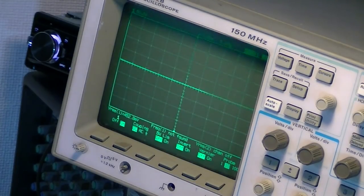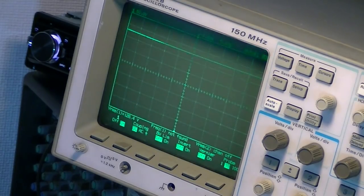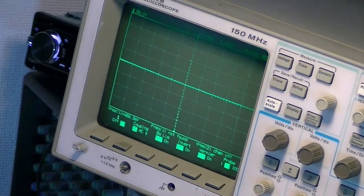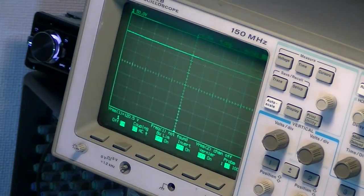Now let's just wait for that voltage to fall down a little bit, because I don't want to be putting my finger on the flipping 126 volts, even though I'm not grounded, I don't trust it. So yeah, power supply is still cold, which is good. Let's wait for that to fall down a bit before I touch it and check for heat.